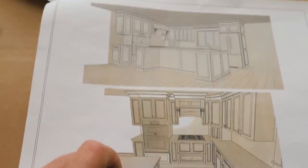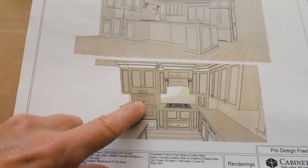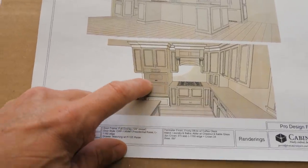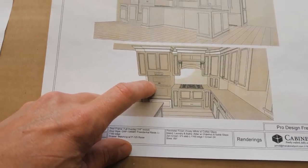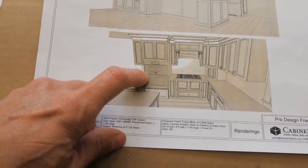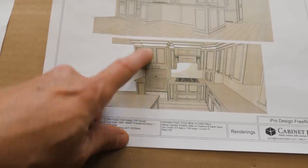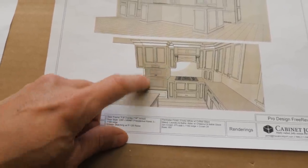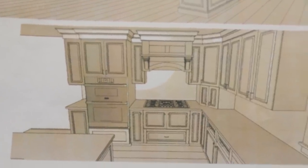And the way they do cabinets like this, where they don't know what appliance you're going to be using, you give them the appliance dimensions and they'll build you what they call the custom size case only cabinet, where you get two sides, a top and a bottom and a back, and they build you the custom face frame to match your appliances.